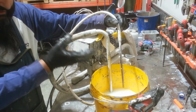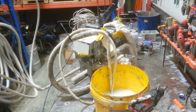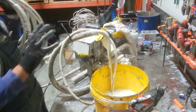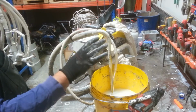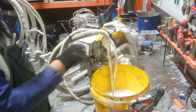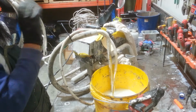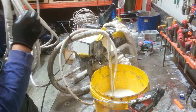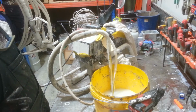So you can hear now that the paint line has actually loaded up, which is why the pump has stopped. Now in this position, without me pulling on the trigger, nothing should be coming. I shouldn't hear a hissing. Nothing should be coming out of here. Now with the Wagners, you can just hear that little bit of creeping. It's because it's got a digital PSI adjustment and it's making those fine adjustments, picking up that little bit to offset the expansion in the hose. From this position now, this spray is good to go.